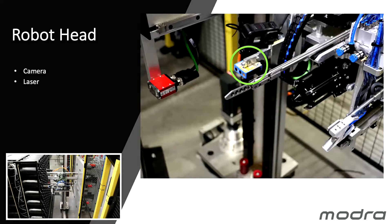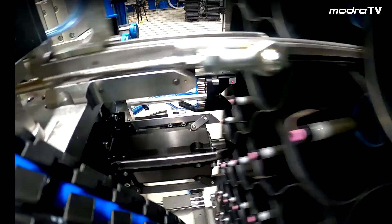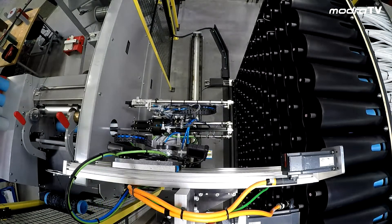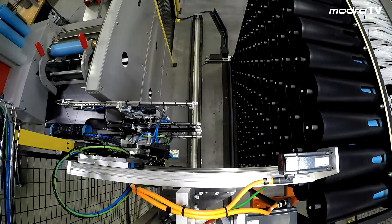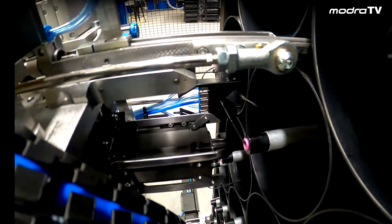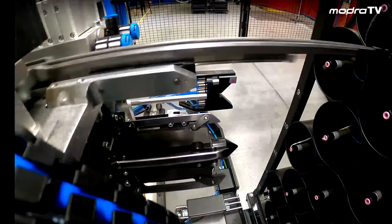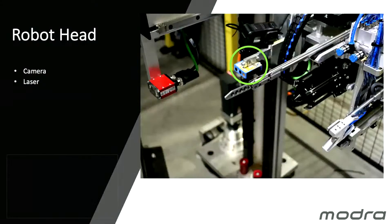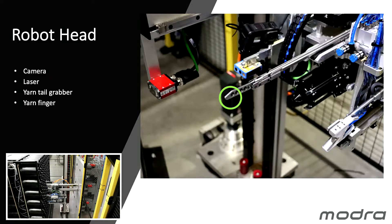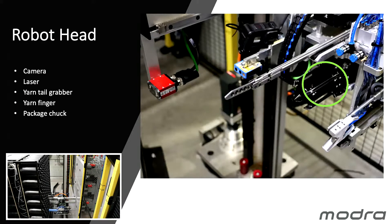We'll view the whole system from a close view and I'll explain the ballooning. Extract the empty, put it in the empty position, pick up the wound package, hold on to the end. The ballooning of the yarn at the transfer position is detected and measured — if it does not occur we regard that as an error condition. Our yarn tail grabber holds the yarn when picking it off the winder and allows us to control it for the transfer and blowing into the centre of the tube. The yarn finger is used for holding the end of the yarn as we blow it through.